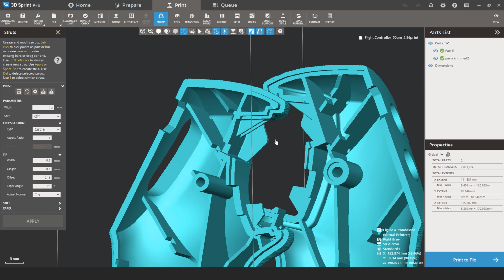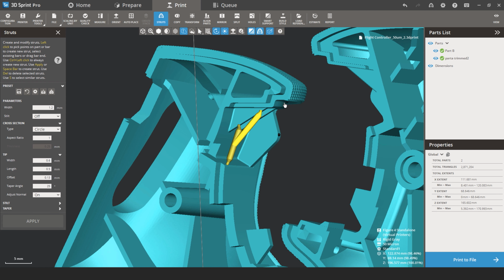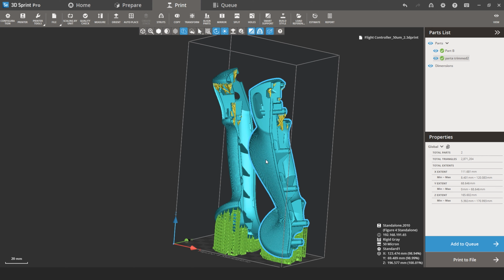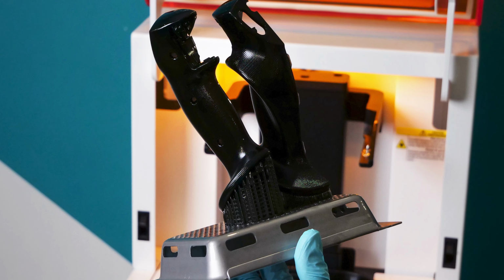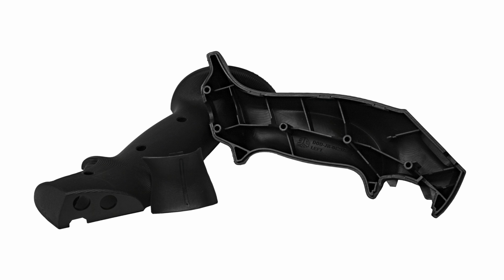With injection moulding, you're typically limited to strict design guidelines such as maximum and minimum wall thicknesses, inability to produce overhanging parts, and risks of warping with flat, thin walls. You're also often left with scarring on components in the form of flashing, whereas with the Figure 4, 3D Systems' easy to break away support leaves little to no trace of where support structures have been.